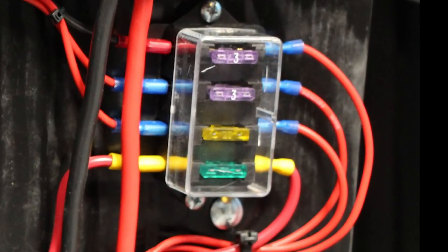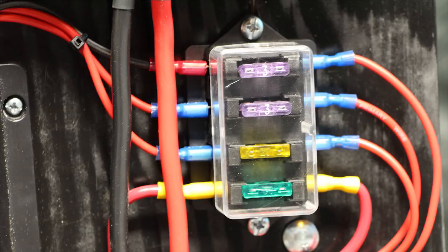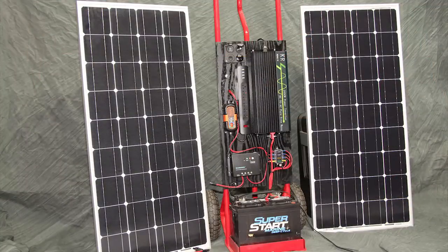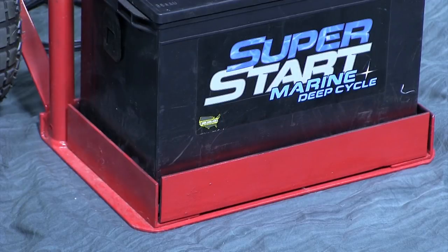Taking more of your suggestions, I added a fuse block so all the circuits are fully protected. The block has fuses for the charge controller, the trickle charger, the 12-volt cigar lighter port, and the 12-volt USB system. This will protect the system against short circuits or overloads. Finally, I'm adding boots to cover the battery terminals, so any metal that may fall onto the battery will not short across the battery itself. The entire unit is built onto a heavy-duty hand truck with large tires, giving it easy mobility even over rough ground and a very compact footprint for storage. It can be moved easily by one person. Should it need to be transported, the battery can be disconnected in a minute, splitting the weight and making it possible to put the main unit in any orientation while keeping the battery upright to prevent leaking. A friend welded angle brackets to the platform to form a battery box complete with diamond mesh and a rubber pad to allow drainage.